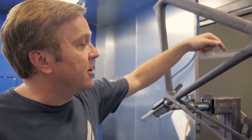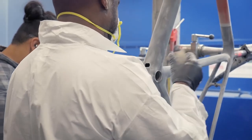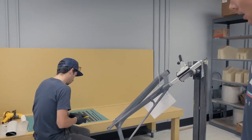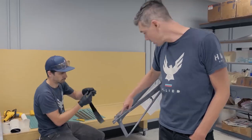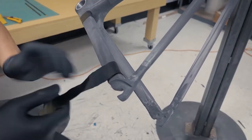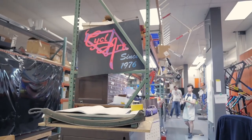In the sanding and paint prep area, we do the drillings for the water bottle cages, the front derailleur mount, and we drill and bond in all of the cable management systems. Randy's giving a final sand on the bond joint to make sure it's perfectly smooth and ready for paint. This bike's been sanded down to get rid of all the excess glue from the bond areas. In all of these molded parts, there's a bond joint designed into it, including a little half-millimeter step for an overwrap. The overwrap is actually a structural component — Olivia wraps zero-degree plies around this, and zeroes are very strong in bending. The overwrap serves two purposes: there is some structural benefit, but really it's to minimize any paint cracking.